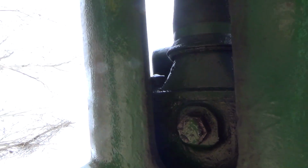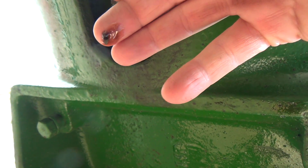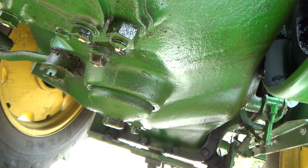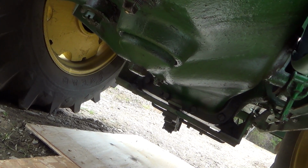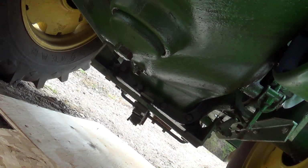And then way up here, you can see the bottom of that radiator hose. There's a plug here, but if I take this off, it's like oily. So I'm a little concerned about that. That shouldn't be oil there, that should be water coming out of there. But anyways, I imagine someone's probably dumped oil on that to keep it from rusting, which is probably not a good thing.